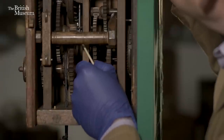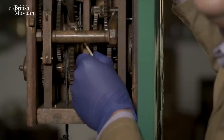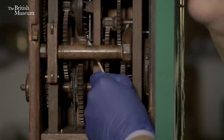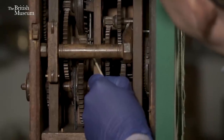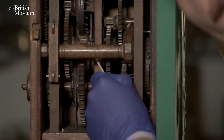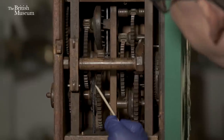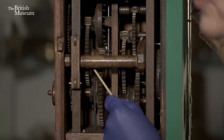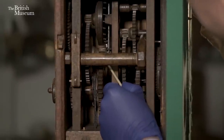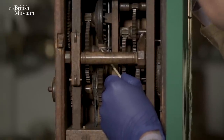It's meshing just here at the top of the wheel with this very small wheel that we call a pinion — all made in wood. This wheel of many teeth is driving this small pinion with not many teeth; the pinion has about seven teeth on it. This big wheel only has to move seven teeth to send this pinion around a complete revolution. We're accelerating the speed of this wheel — you can see it's moving quicker here — and the last wheel in our train, the escape wheel, which we'll come to next, is moving around visibly quicker again.